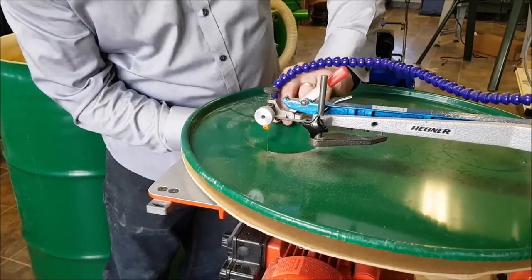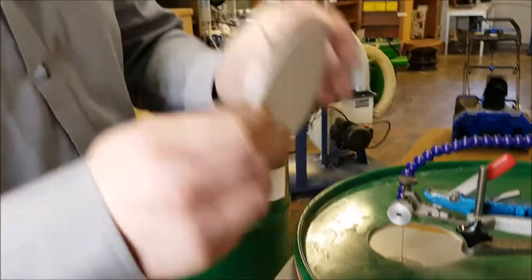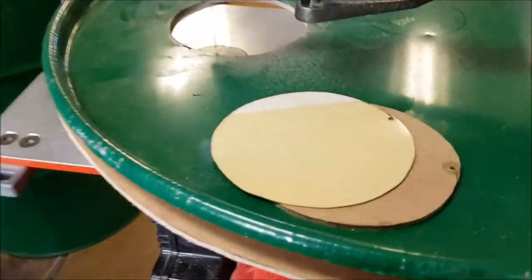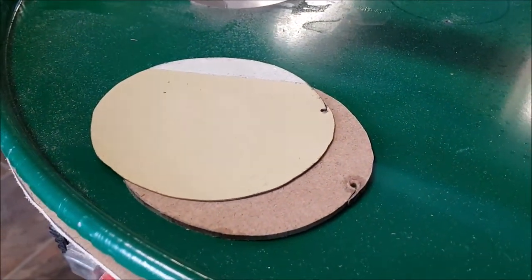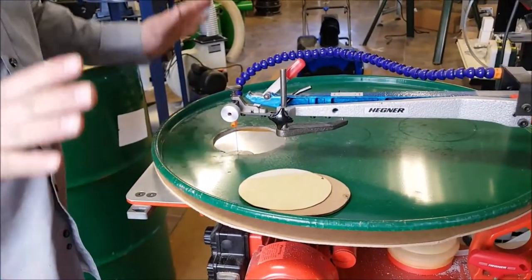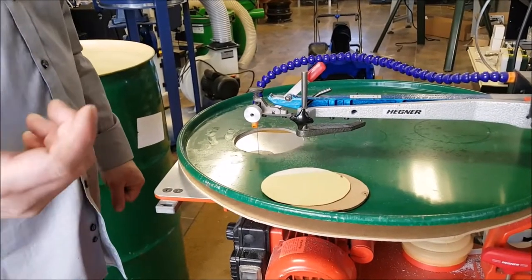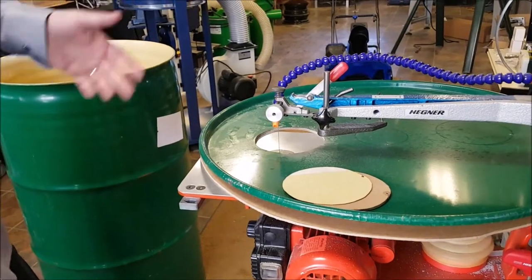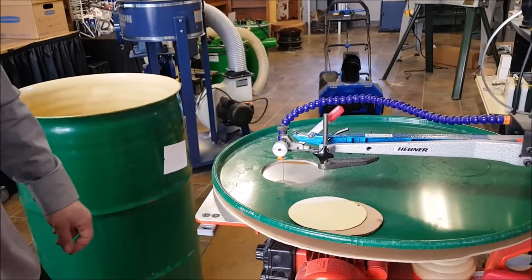Okay, that's our first cut — there's the steel. You can see it's leaving a nice clean edge on the bottom because of the MDF backer. I did break a couple of blades on the first round, so you've got to make sure you go nice and slow. It's a bit of a learning curve. If you put too much pressure on that blade you're going to break it — it's just the way it is. With the small teeth and the metal, it can make heat real fast. I'm going to carry on and do the rest of these and we'll see what the finished product looks like.